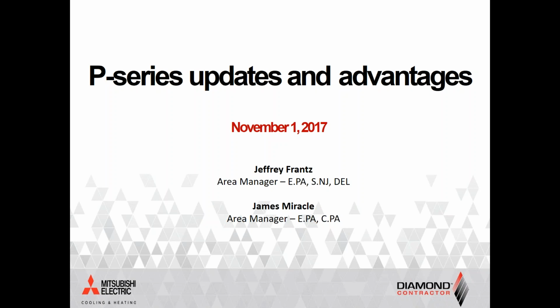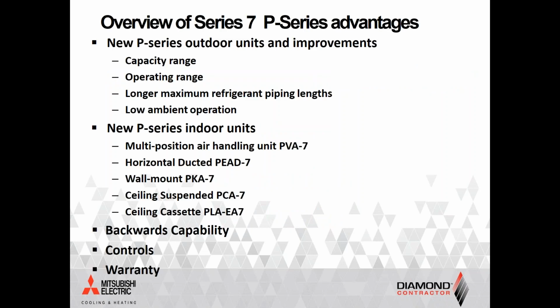Today, I want to spend some time going over the Mitsubishi P Series, exclusively with the new Series 7 that has come out, and go over some of the updates and some of the advantages with that system. We'll take a look at the new P Series outdoor units and the improvements, the capacity ranges, operating range, longer maximum refrigerant piping lengths, low ambient operation. We'll take a look at some of the different indoor units: the multi-position air handler, horizontal ducted indoor unit, wall mount, ceiling suspended, and the ceiling cassette. We'll talk about the backwards capability, controls, and also warranty.